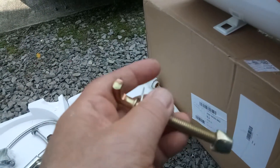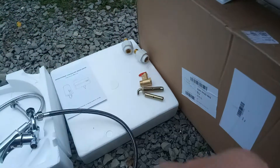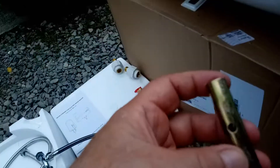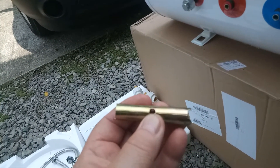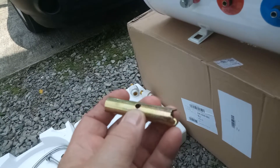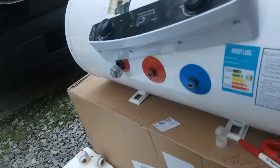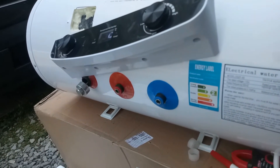If you're thinking of hanging this in sheetrock, forget it. The expansion only goes about an inch and a half, so sheetrock won't give you enough depth. When this is filled with water you're talking about 140 pounds, so it needs to go into something substantial.